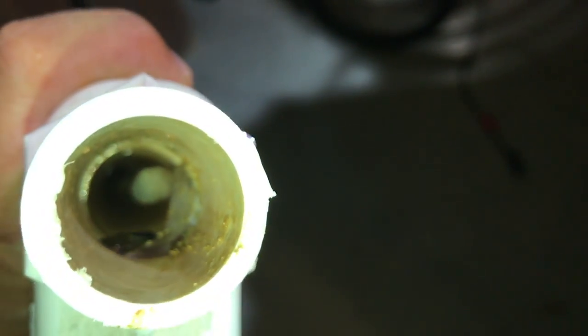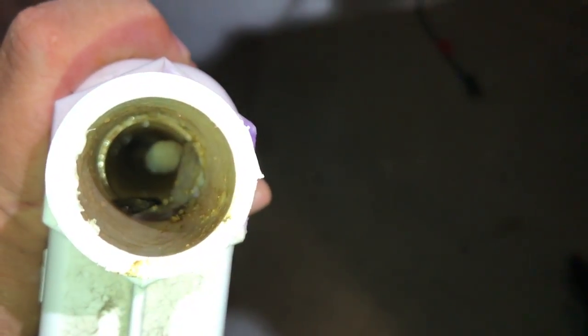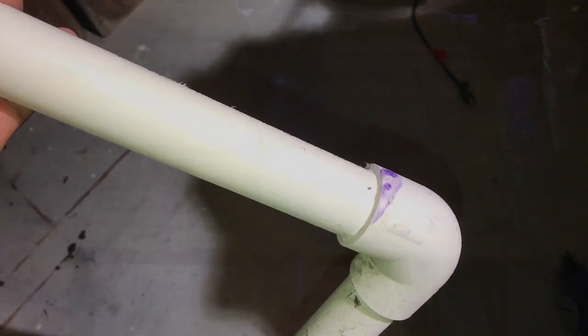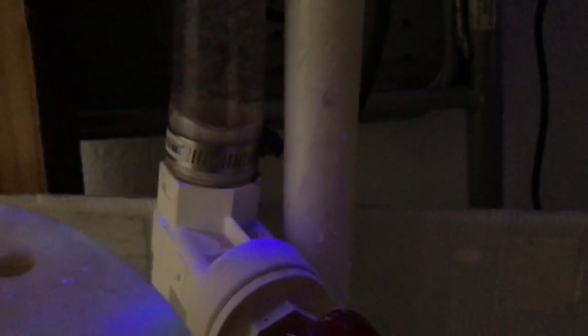Another great thing is this gate valve. I'm gonna use this gate valve to silence the drain a little bit. I'm not using a Herbie or anything like that, just a plain old simple gate valve — I used this on my 120. If you don't have an emergency drain I highly do not recommend doing this, because you want to keep the one-inch drain free at all times. But since I have two drains I'm gonna go ahead and adjust this to silence my tank. Here's what my tank sounds like with no gate valve.